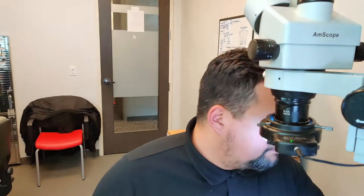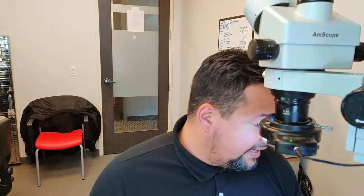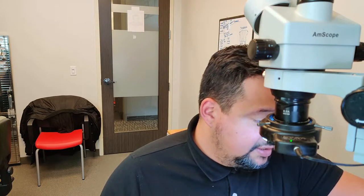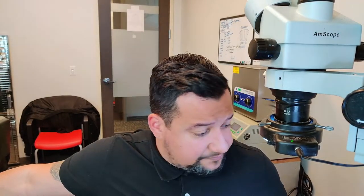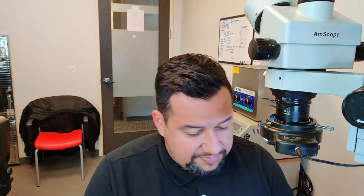In these boards, if you put one drop, give me 1 second, I have an issue with that camera. Okay, there you go. One drop, just one drop of water close to the CPU and it's gone. It's very hard. I will say every time I have an A1708 with water close to the CPU, the computer doesn't work. Some CPU lines are too low, almost shorted. And okay, so those lines are too low, and the CPU doesn't work.